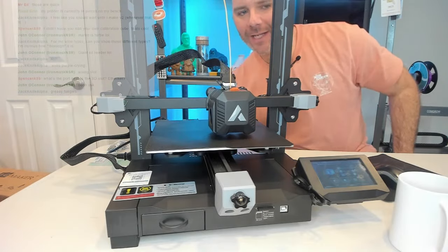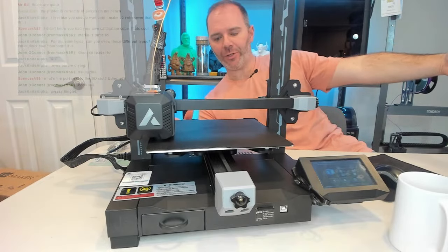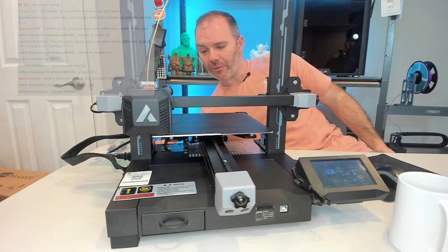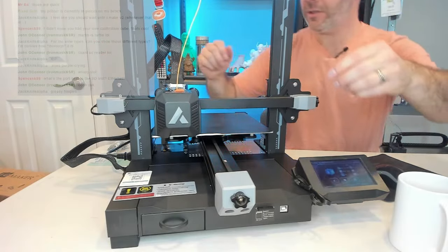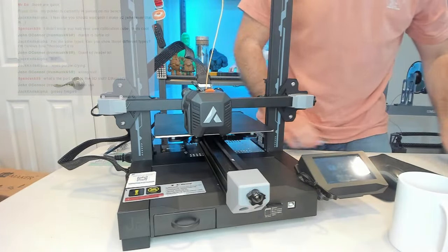So the slicer profile they had for this, out of the factory, had no bed probing in it. We saw that in the start G-code. A new printer is not going to know that's a thing. So we had to make that adjustment. Really something JG Maker should do. Let me show y'all. So are we auto leveling? We are. All right, so we're auto leveling, it's working.